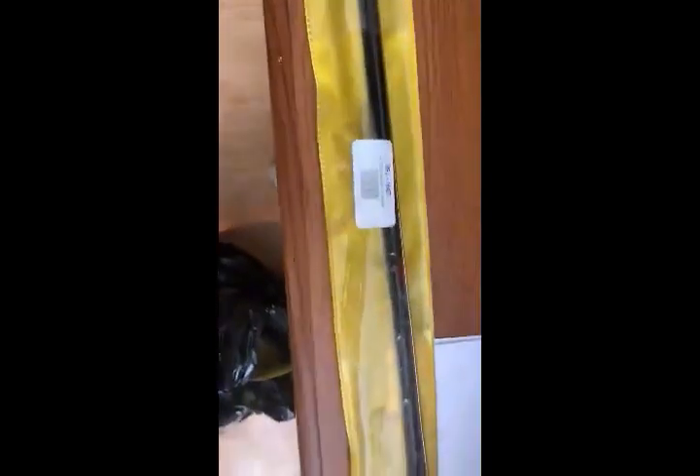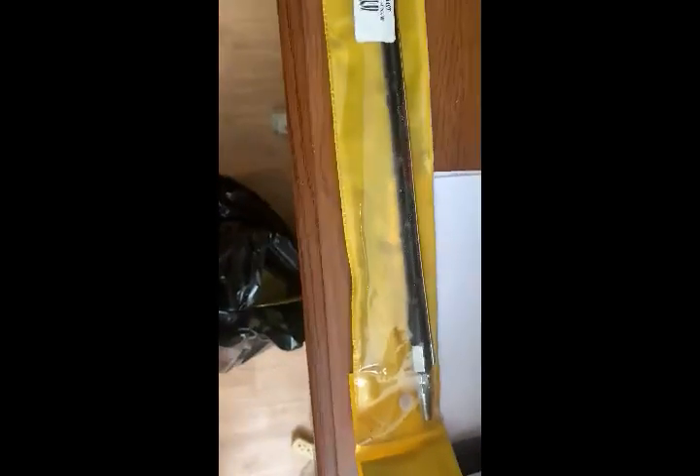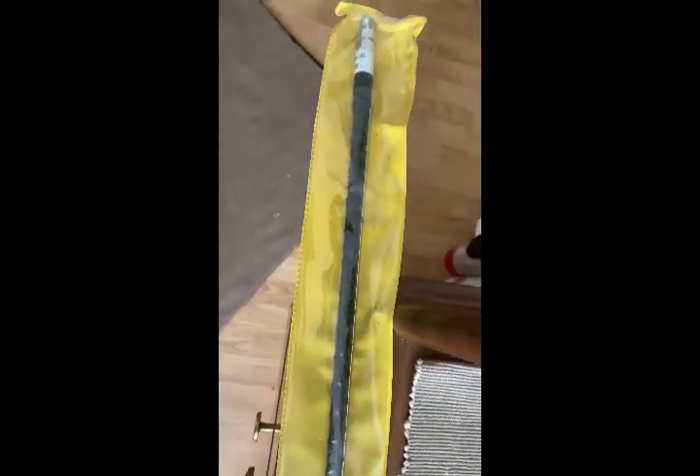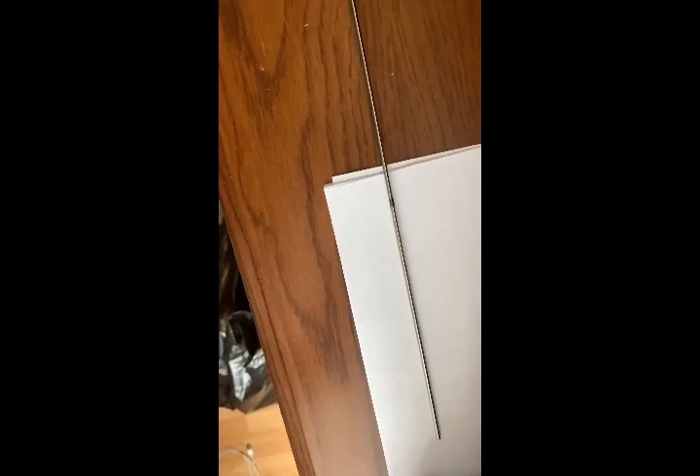From one end to the other the hamstick is about 51 inches; the whip is about 48 inches. On mine the whip tends to go in between four and six inches either way, and my IC-7300 can easily tune it up. You can see the mark I've put on mine — I know pretty well where each antenna will tune up, so I just slide it in until I hit that mark.